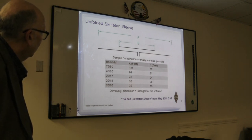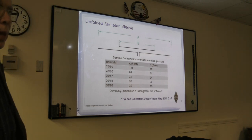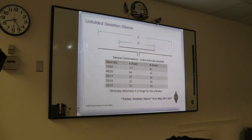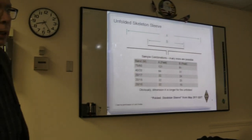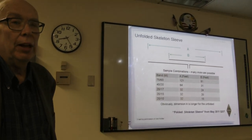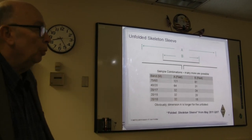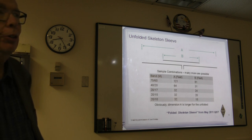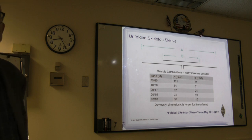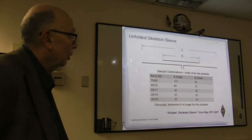the distance is there. The big difference is always the low band, and one of the characteristics, which is rather interesting, when you have just a plain dipole up high and clear of stuff, it has an impedance of about 70 ohms. When you do this coupled resonator, the impedance is brought down to close to 50 ohms, so that if you do things right, you can get a very good match on two bands, very close to 50 ohms on both of them, as a matter of fact.